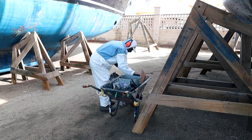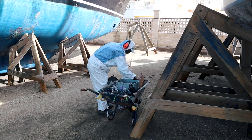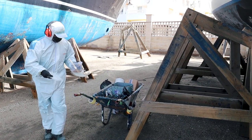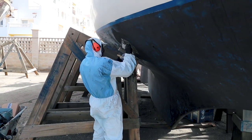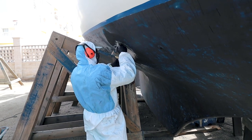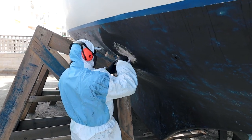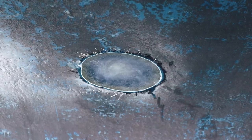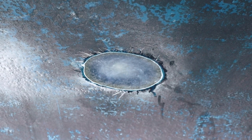So back to the process. What Davide did is cut out different-sized pieces of fiberglass cloth, starting with the smallest diameter — just the size of the hole — and then getting bigger and bigger until you reach the full size of the ground-out area. What that does is give you the negative shape of the grind you did before, and you end up with a fiberglass cloth that is flush to the hole.